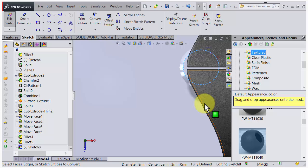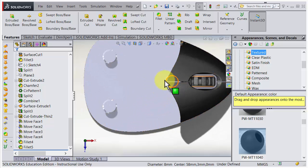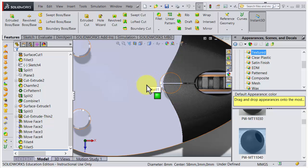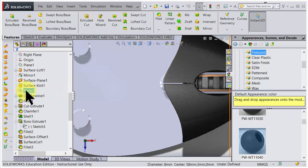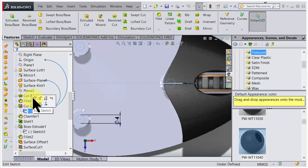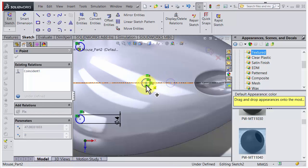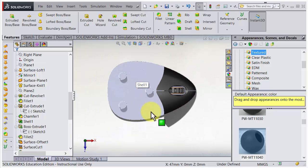Let's cancel and discard all changes. I just want to move that screw tower position. If the screw tower goes up to the top surface and not into the buttons, we need to find that circle - it's almost at the top. There's the cut extrude and the sketch - if I go into the sketch I can move this a little bit here. I accept the sketch, everything updates, and now it will not interfere when we make the screw tower all the way up.